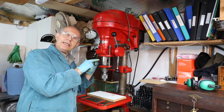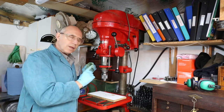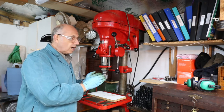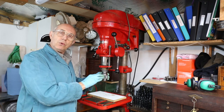This silver piece just here is the quill. A quill is a shaft that contains a spindle. This shaft is the interface between the turning world of the chuck and the stationary world of the casting here. It contains the bearings that support the chuck.